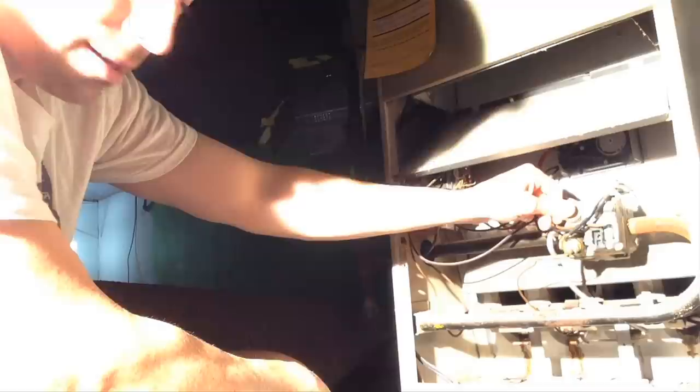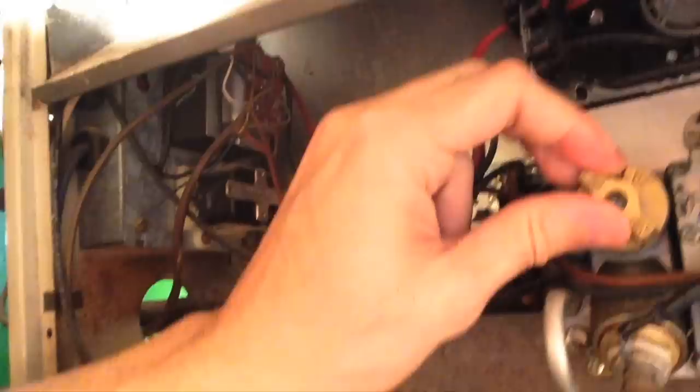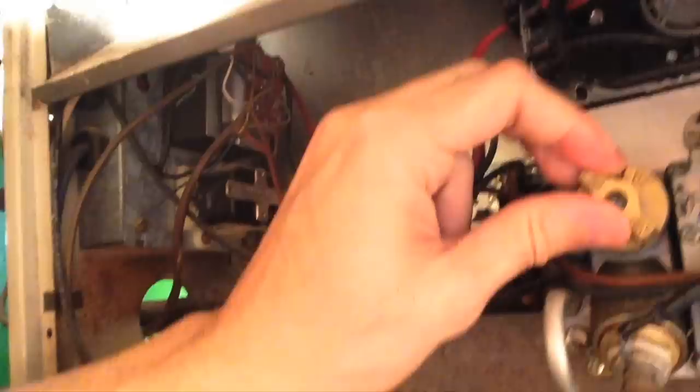I think it's been about a minute. Let's test it — I'm gonna let go and see if it stays lit. Yeah, let go of it and it stayed lit. Okay, now we're gonna turn this to the on position — you have to push it in a little bit. Now it's on. From the pilot to the on position and it stays lit, and that's it. So you just slide the door back on and turn the power on again to the unit. And that's it.